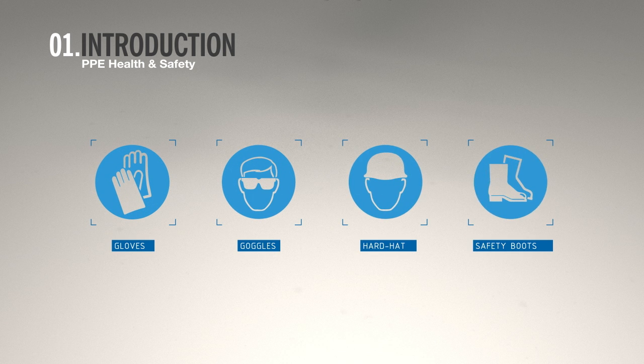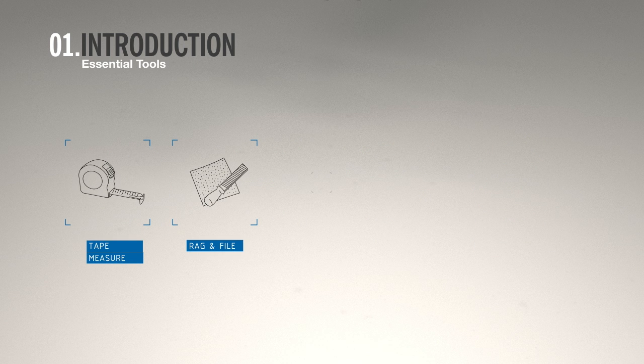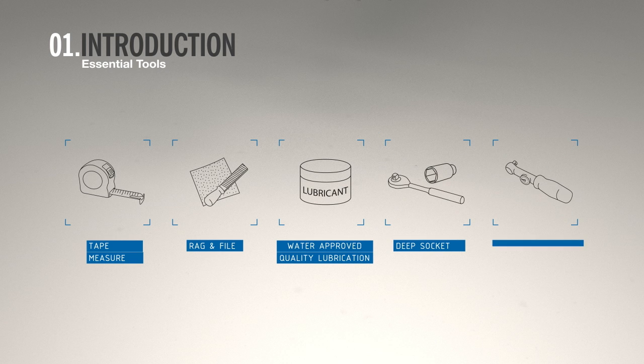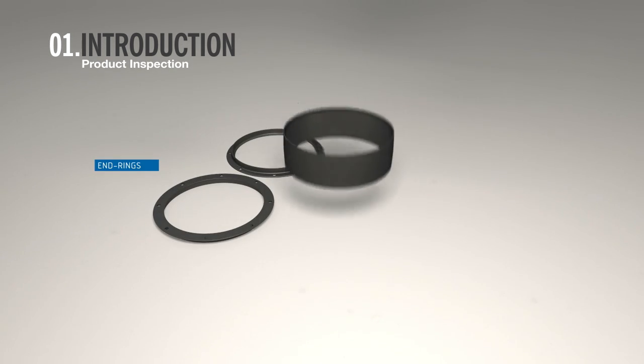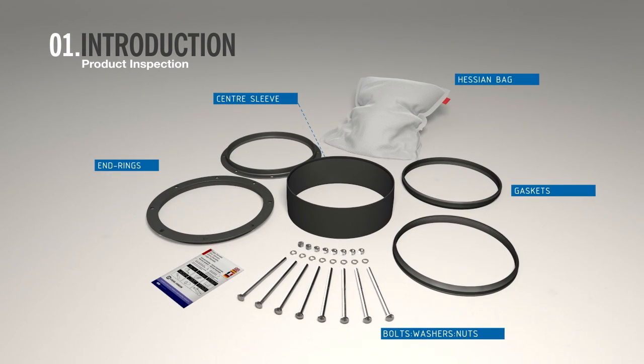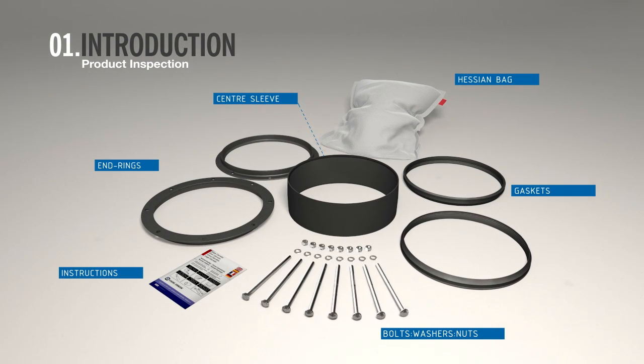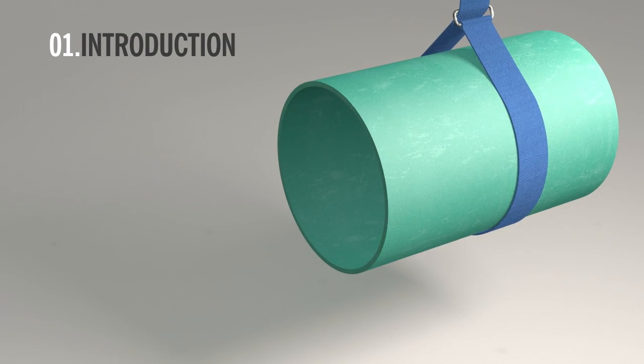Please follow health and safety guidelines. Hand protection, eye protection, a hard hat, and safety boots should be worn at all times, as well as any other site-specific safety considerations. You will need a tape measure, rag and file, a water quality approved lubricant, a deep socket, and a torque wrench. Check you have end rings, a center sleeve, and in the hessian bag: gaskets, bolts, nuts, washers, and fitting instructions. Then lay out all componentry and tools onto a clean and dry surface in preparation to fit, and be sure to observe manual handling regulations.